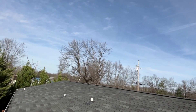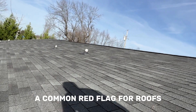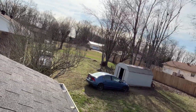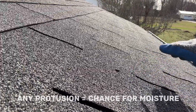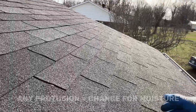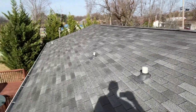It's two layers over. We've got one existing layer on a four and 12 slope, and then they laid another layer on top of this. The trouble with doing two layers on a roof is that the old shingles have nails protruding often, and those will come through your new layer. This roof is only about three to four years old. We've got protruding nails, which is a problem going forward for this roof and could cause ongoing moisture intrusion issues.